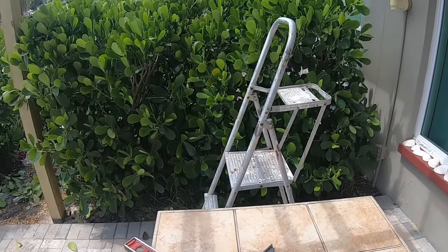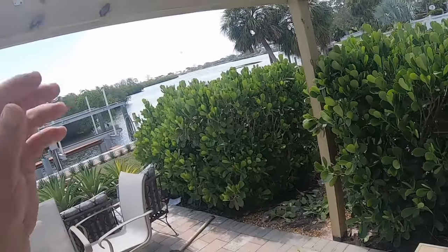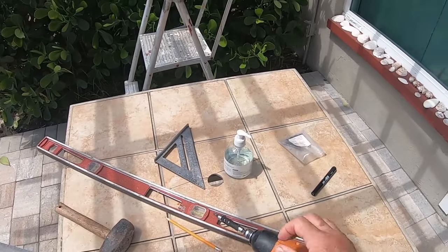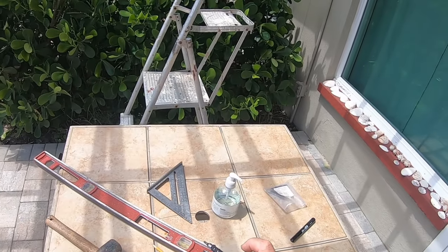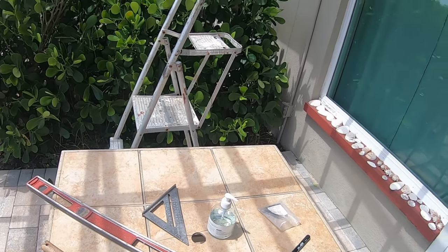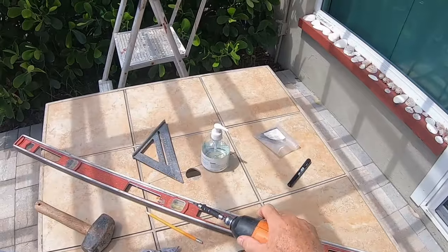Choosing the right screw, I'll put one at one end and one at the other end, and probably one in the middle, because these things will spring this way. But since I got about 1.5 inches, these are 2.5 inch screws, so I'll have 1 inch into the cross beams here, and kind of pisses me off.